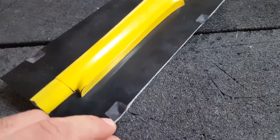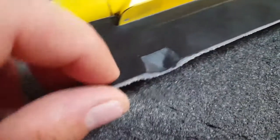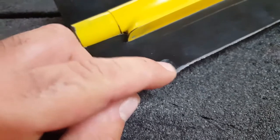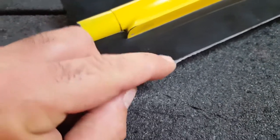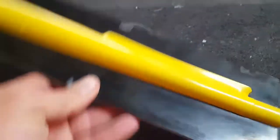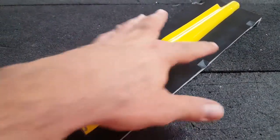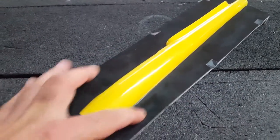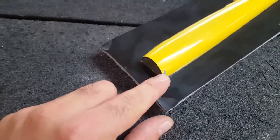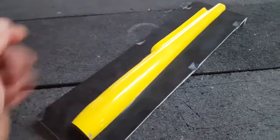I have these spots where I used clay to make alignment marks or index marks, and you can see they're not really that great — not super smooth — so I'm actually going to go in here and sand these a little bit and round everything out and smooth it all out just to make it a little bit nicer. Pretty happy with the result. I'm going to clean up this surface, maybe polish it a little bit, address these spots and touch this up, then apply more mold release and lay up the second half of the mold.